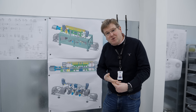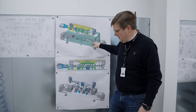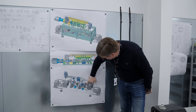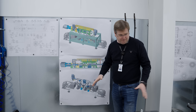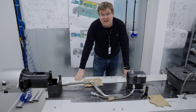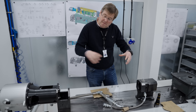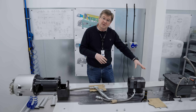Underneath the rig we've got all of the functions that the core of the engine provides to the speed reduction gearbox - lubrication pump, thermostatic valves, pressure relief valves, all of that good stuff that's on the engine is represented on the test rig here by industrial motors, industrial gear pumps, standard hydraulic lines and fittings, and the tanks and control systems that go with that. The structure of the bench is designed to be very stiff in comparison to the gearbox structure, so the bench itself doesn't influence the performance.